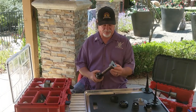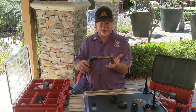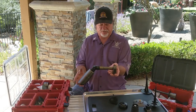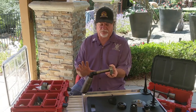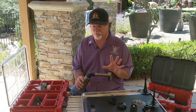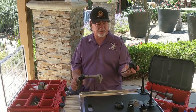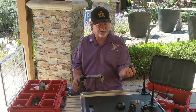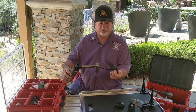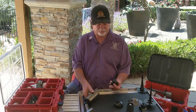I want to show you something we had to do a couple weeks ago on a job. We had to get light on a barbecue coming off a post, projecting out over some type of obstruction, but we had to make it aesthetically really clean. We used this configuration mounted like this — coming down under the barbecue. We had to get the wire to that location without running wire that would look weird, so we used so-cord. Then we used another wall adapter coming off the same metal structure beam — we drilled through the post — so it matched, and the wire went through into the fitting.